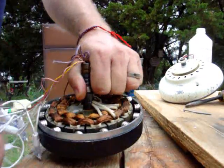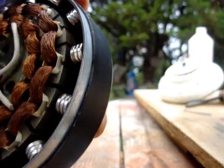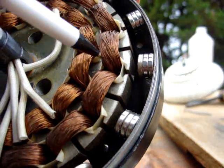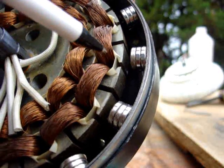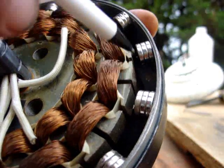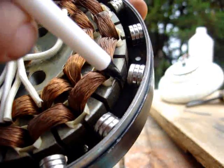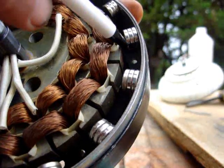Here's one somewhat completed — let me take a nice quick close-up. Notice how this piece of metal here goes around like this and is split right here to get the wire in, then it's the same thing over here. These two pieces of metal join right here and come through and out here so that a magnetic force on this pair runs through these two coils.